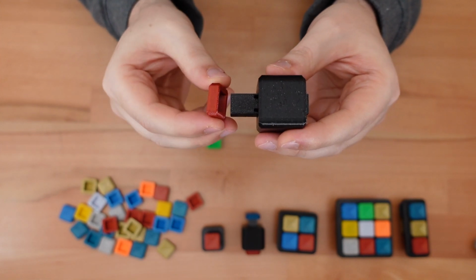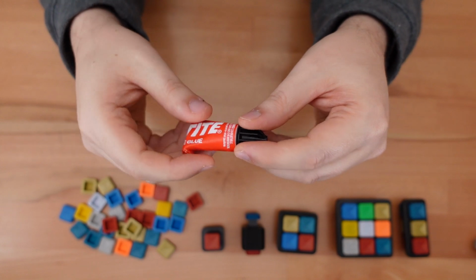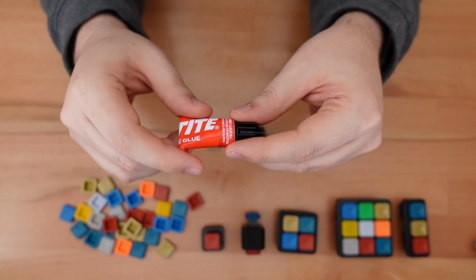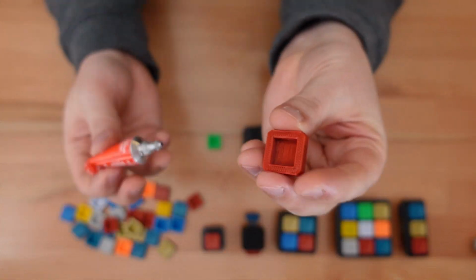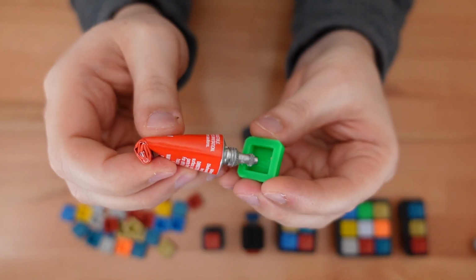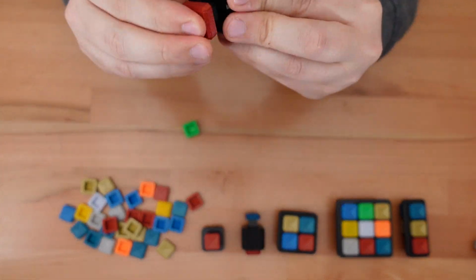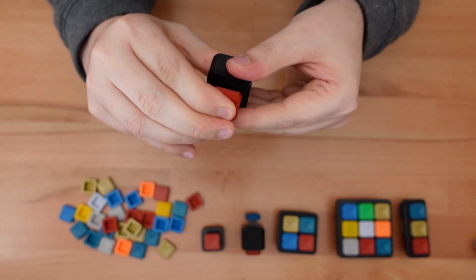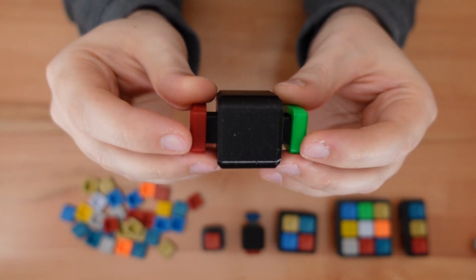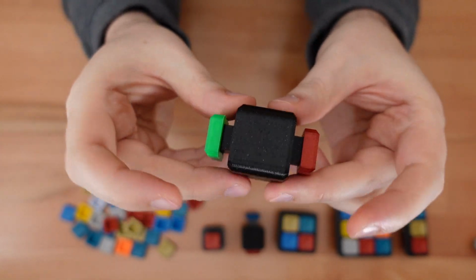Once the spring is in, it's time to glue on the caps. I decided to use a gel glue for this project to make sure the 2 parts hold together, even if their surfaces don't match up perfectly. As the glue dries, push the mechanism into a half press, so that way neither button touches the frame and glues it all together.